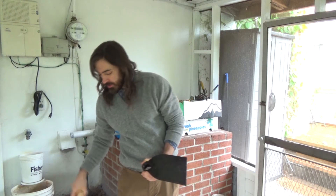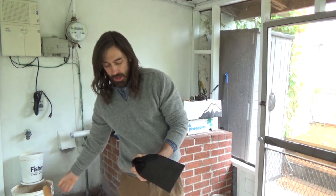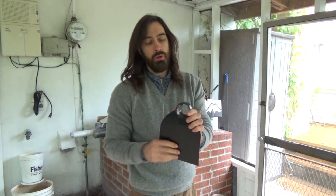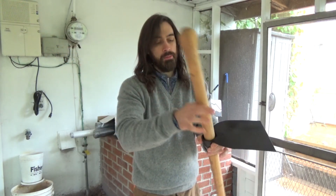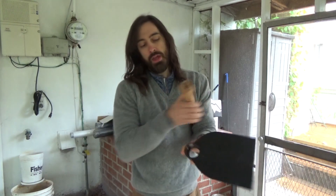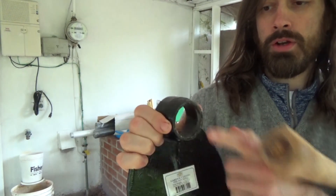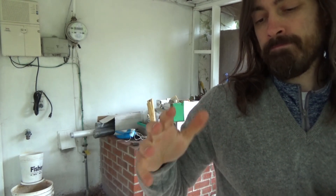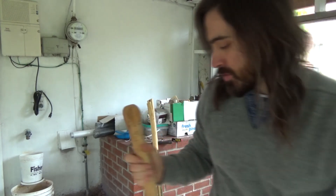I did a few measurements. This is also just a cheap handle anyway — you can tell it's basically a table leg. This part here is called an eye hole, and handles slide in through the top and taper, so the handle gets a little bit wider and the head tapers too. This side is about two inches across, and this side is one and three quarters. So I need a piece of wood that's slightly more than one and three quarters where this would mount. That's what I'm on the hunt for.